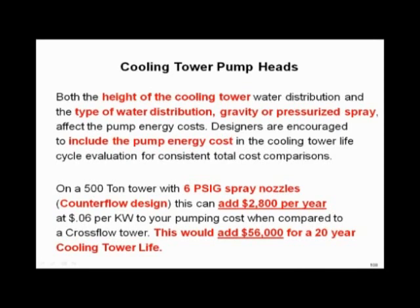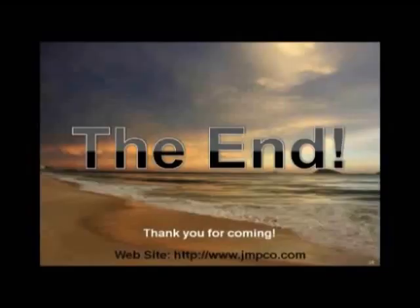The main thing I'm trying to get across: don't come up short. ASHRAE says you've got to do a detailed pump head loss calculation. When you do that, account for this to make sure you've got the right pump head on your condenser water pump. Thanks for tuning in — have a great day.